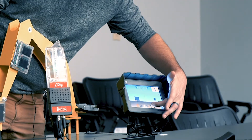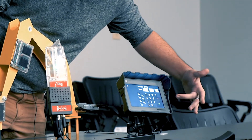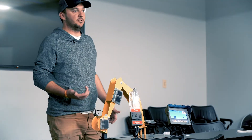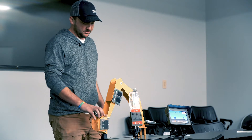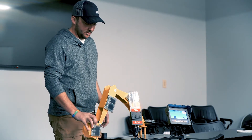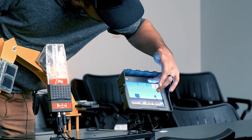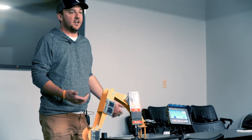From the display system you'll go to this little pencil here, say 'I'm on grade,' and hit the green check. As you can see, our grade indicator is now showing green, so we're on grade at the moment. If I drop down, this is going to tell us how high or low we are. It's showing about three inches and it's three inches on the dot, so this is calibrated.